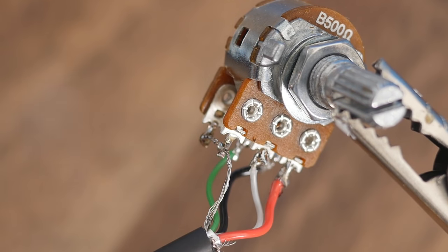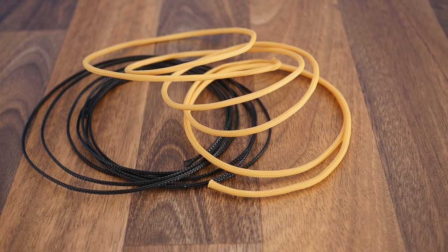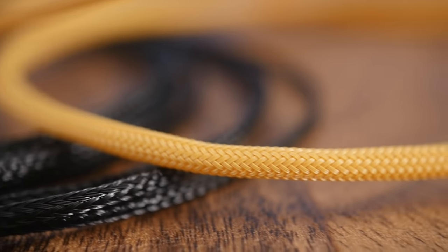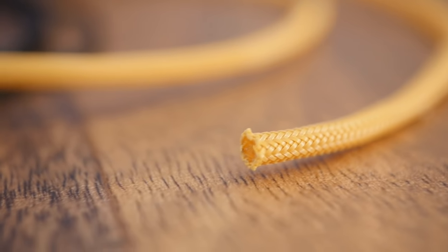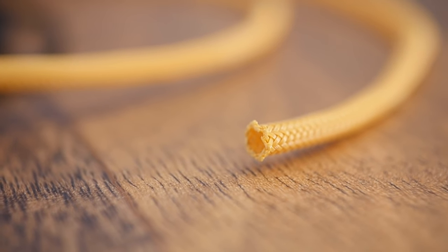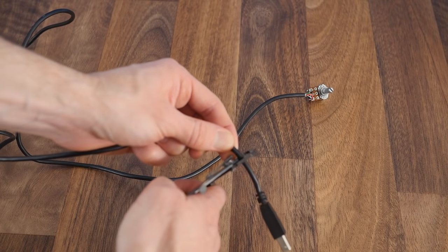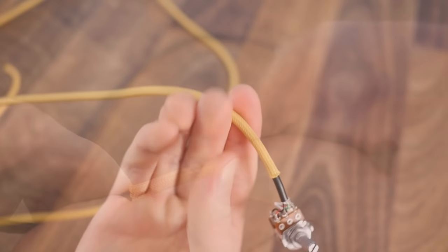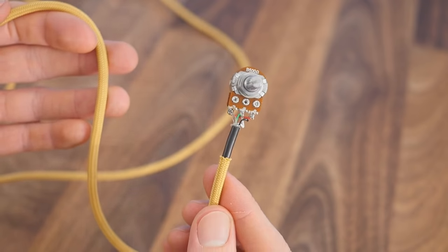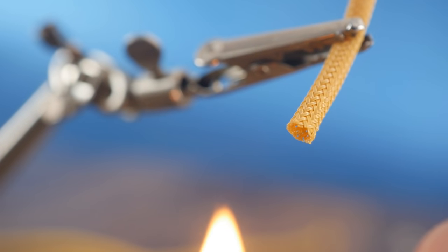With that wired up we can now add the audio connectors, but before we do that we can decorate the wire with some braided sheathing. This stuff is really inexpensive and is available in a variety of different colours. I'm going to go with a muted yellow colour to be somewhat colour coordinated with the base, but you can go with anything you like. To fit it over the cable we'll first chop off the other end, and then feed it all the way along the wire until it's 2cm away from the potentiometer. We can then chop off any excess from the other end. As this sheathing is liable to fray however, we just need to seal it by melting it slightly with a match.